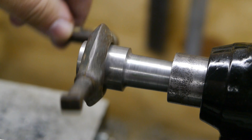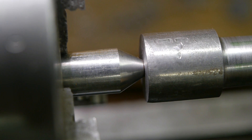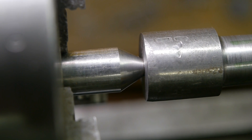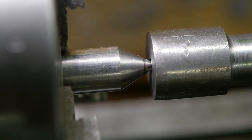So now comes the difficult part: drilling a hole in here that will be precise enough to hold a center drill, preferably without any run out. It looks like I still have a tailstock alignment issue — this could either be wear in the bed or the tailstock casting, or the internal taper in the quill is still not done correctly. Well, it's pretty pointless to drill a hole now, so I guess I failed again at making a center drill holder. At least I had some fun this afternoon and might have learned a thing or two — and I had a nice nap watching the Formula One. To be continued.